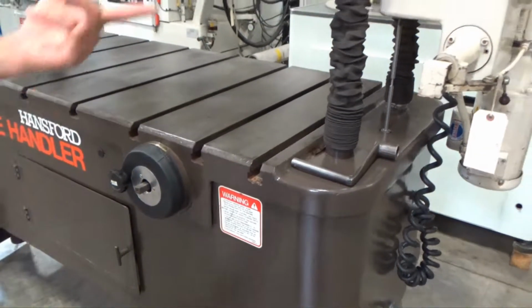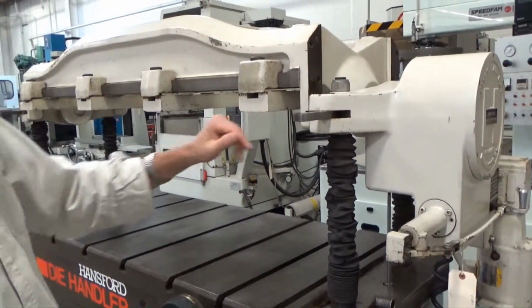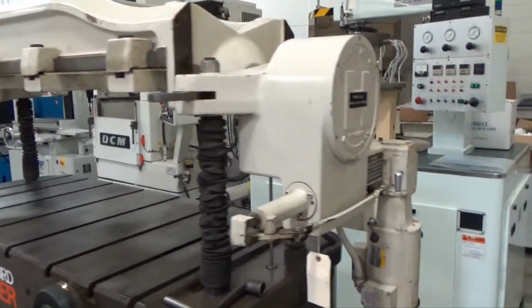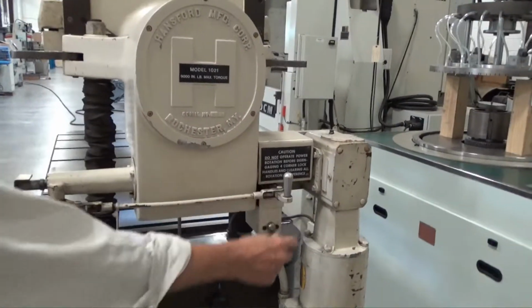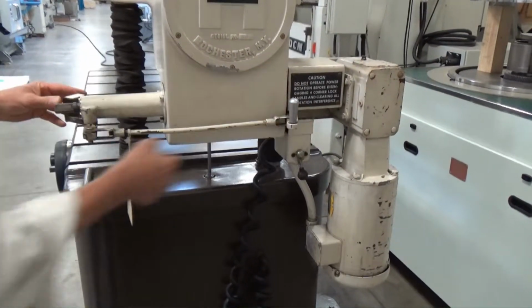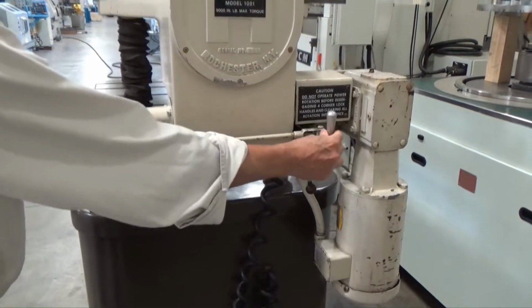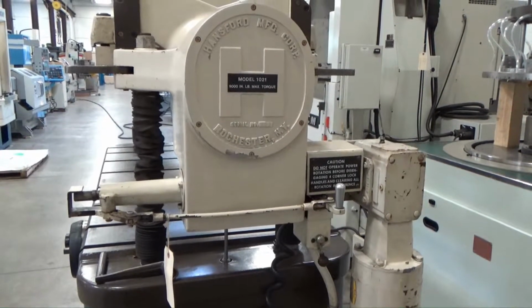And on the side, of course, you got 4 locks for the tilt mechanism, and we have a power drive for it also. This is a safety, which won't allow the rotary drum switch to work with the motor if the safety's out of place, because if you have the crank on there, of course you'll get hit. So we can go in this mode under power. Of course it'll crank, but we're just going to run the power for today, and that's all.